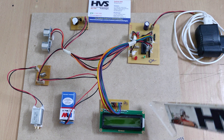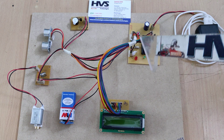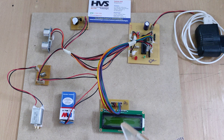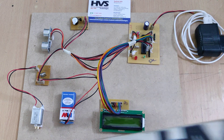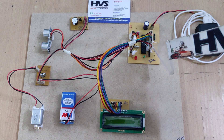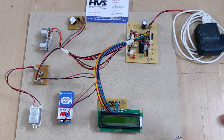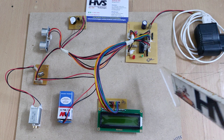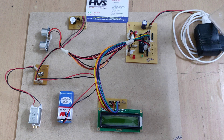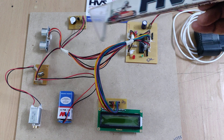For demonstration purposes we are using an LCD display; in real time it is not required for the blind person. The SR04 is interfaced at pins A0 and A1 of our PIC16F72 microcontroller. Output modules are: a buzzer at pin C3, a vibration motor through a MOSFET driver at pin C7, and a 16x2 LCD module at pins B2 to B7. The system draws power from an adapter that converts 230V input to a constant 5V supply for the microcontroller.